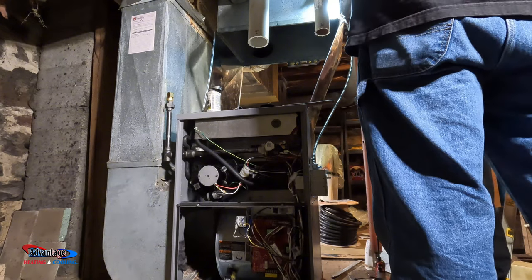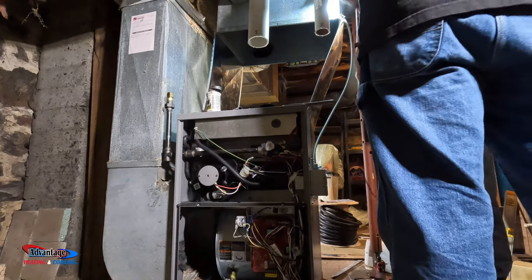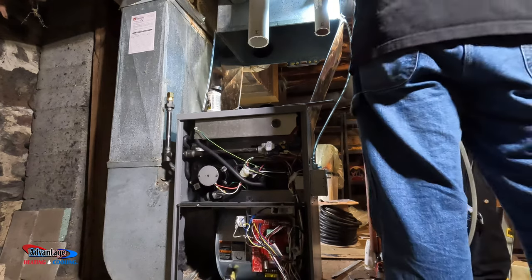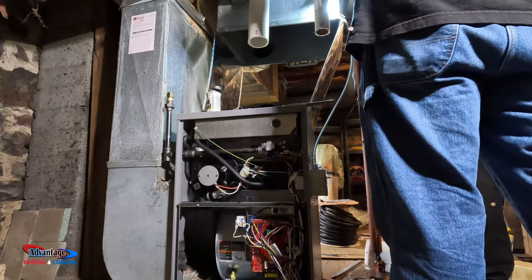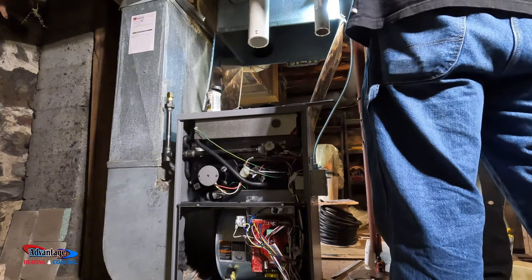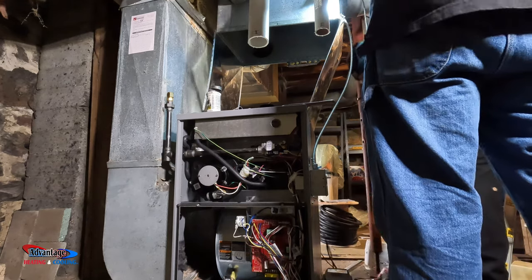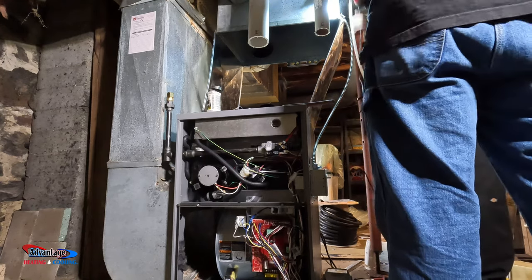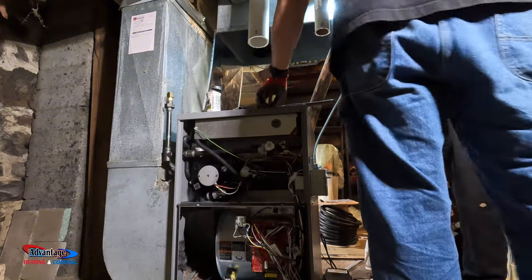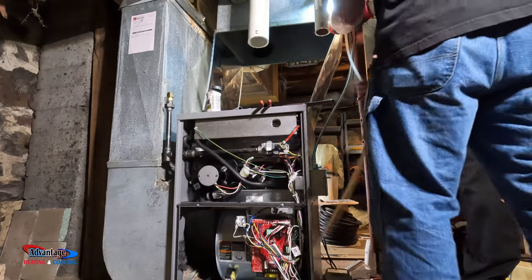So did you hook all the wires up upstairs and set? Yeah. So we got a fan, 24 volts and heat. So there's only two wires in there. Oh, there is? Yeah. So what the hell, they must have spliced it. So I got white and red. I must have spliced this switch. Think so? Yeah, because there's four wires in here. Strap it up. Yeah, we can cast the zip ties and strap it all up, and then we can put the pieces off.